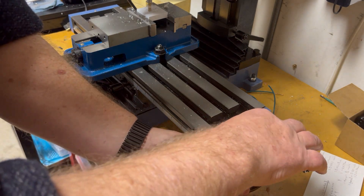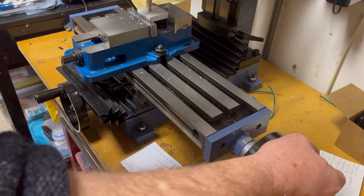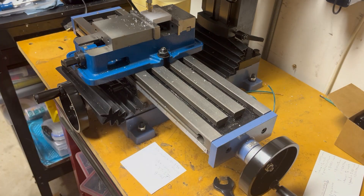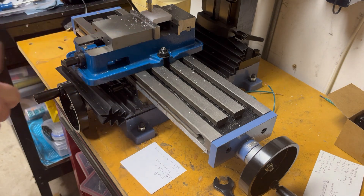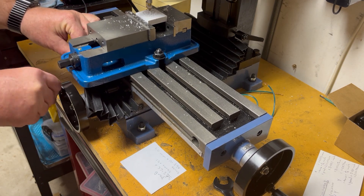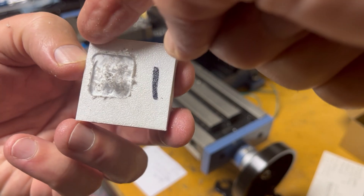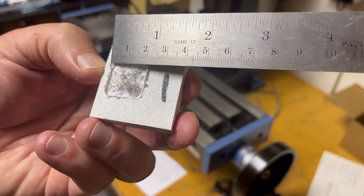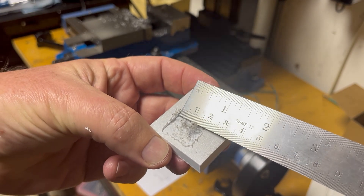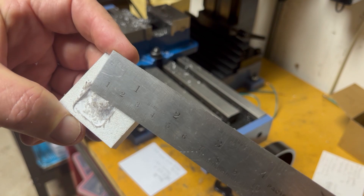There's a bit of backlash in these handles as well. That's expected for a mill, but one more thing I have to watch out for is to move the handle back and re-zero it to get rid of the backlash. The final y-axis cut was to go back again - something like 12 turns, 37 graduations. I must have missed one of the turns because it doesn't line up. I got lucky it was about 20 millimeters, but I wouldn't want to measure that too exactly. More luck than good management got me there.